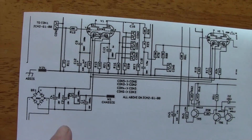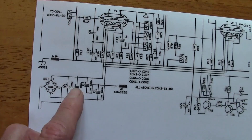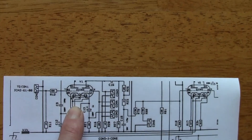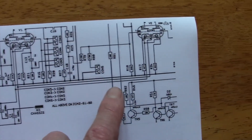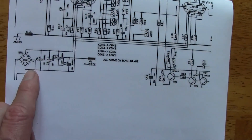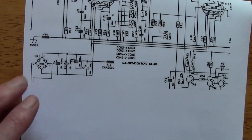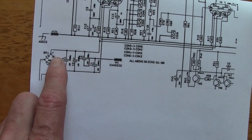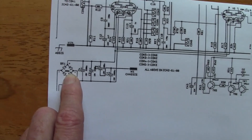I did remember correctly. You can see here we have a little bridge rectifier, AC coming in, bridge rectifier, a bit of smoothing, off we go to the heaters of V1 and then looped through to the heaters of V2. So the first two valves are fed DC. Now the fact that this sprang to life and then died again - I'm guessing there may be a dry joint on this bridge rectifier or somewhere around here. It's possible the bridge rectifier is faulty but I'd be surprised; I'd expect it either to work or not.